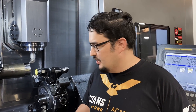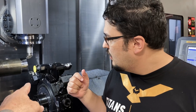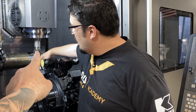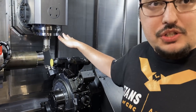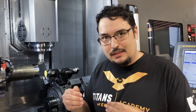For balance turning you have the tool on both sides of the spindle, so they're opposite from each other and turning at the exact same time. So you've got a tool down here hitting the bottom of the material and a tool on top — since this is a nine-axis mill turn. For pinch turning, we're going to take our tool pass and split it between two tools. One's going to go in first, then the other comes in right afterwards doing the second pass.